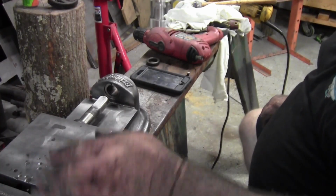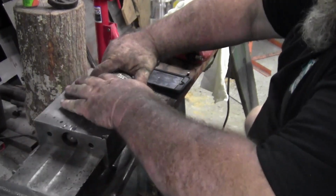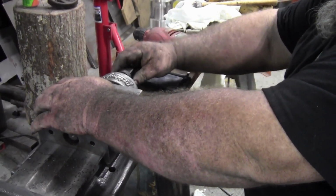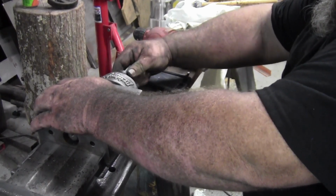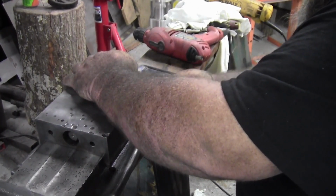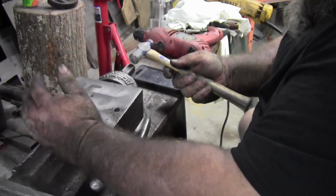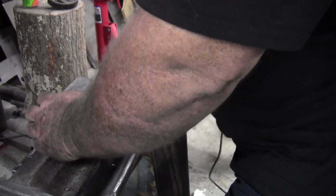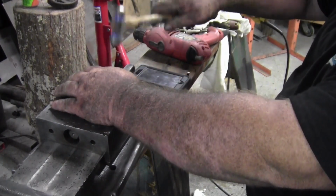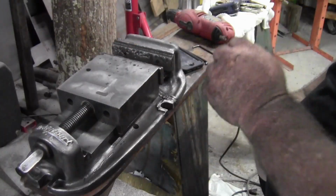Okay guys, I had to take it back apart because the worm screw needs to go in first. Also, there is a bushing on this side and a bushing on this side before we return the ring with the roll pin to its proper position. Roll pin in. Now I just need to put the jaws on. Okay guys, I got the jaws installed.